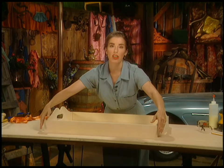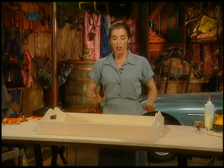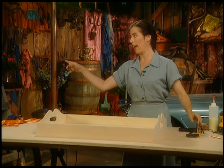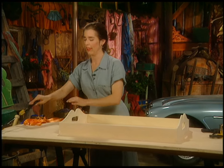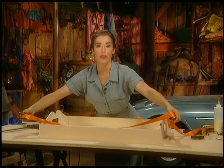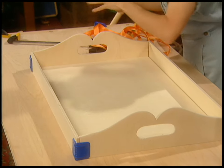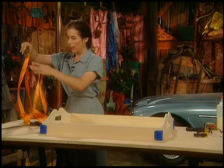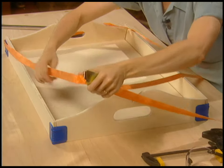Before you start gluing, think about clamping — the glue needs to be held against the surfaces. You can get really long clamps, but they're a bit awkward. I found a strap clamp: it just fits around like this and pulls all the corners tight, with smart little protector pieces so the webbing doesn't dig into the wood and make gouges. Do a dry fit first to make sure you've got the size right, then take it apart and glue it.